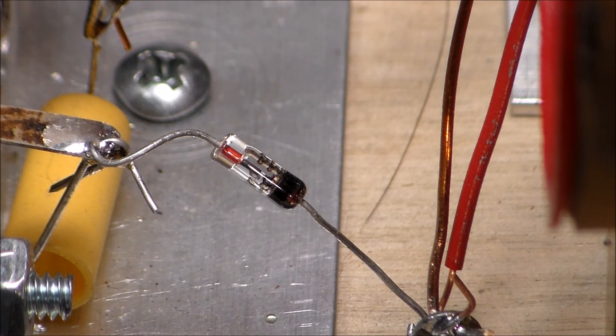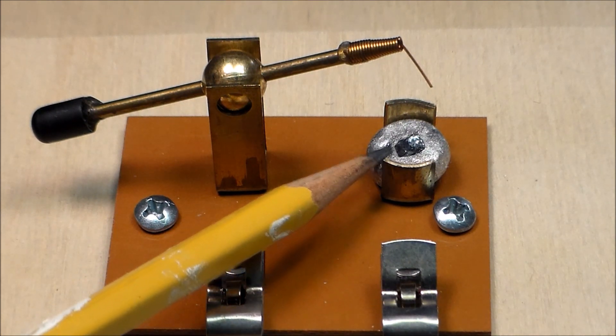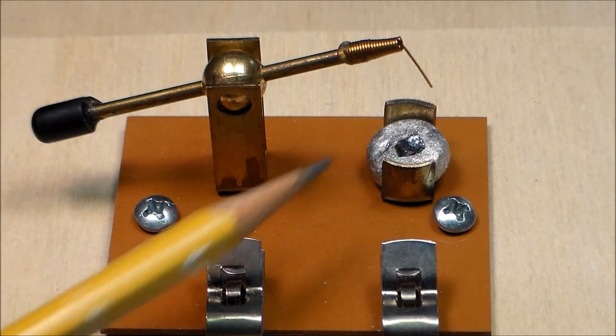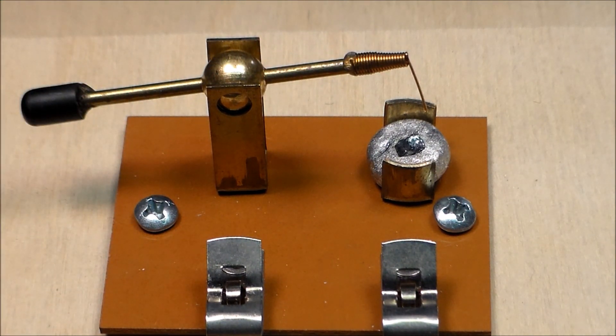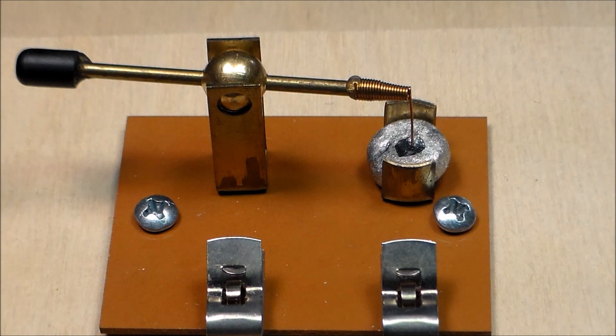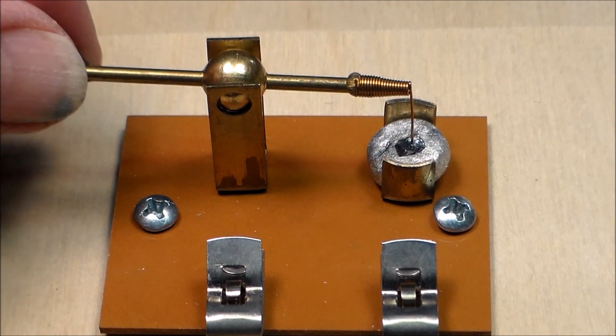Let me show you the crystal you had to deal with in the 1920s. Here is a facsimile of the catwhisker crystal used in the first crystal radios. Down here are just terminals to connect the crystal to the rest of your circuit, but up here is the galena crystal ore. There's a little piece of wire here — a probe — called a catwhisker. The catwhisker is attached to a movable arm. The purpose of the crystal in the crystal radio is to conduct current in one direction only, so the circuit has to be closed — in other words, the catwhisker has to contact the crystal. Not all spots on the crystal will work; a lot of them are simply dead. So the operator has to search around with his catwhisker, moving the probe, until he finds a spot that works.